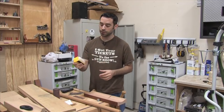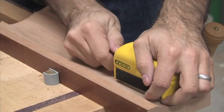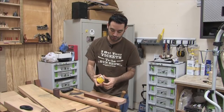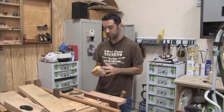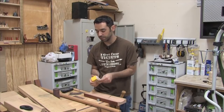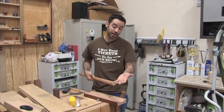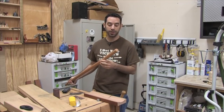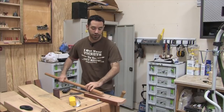Here's another option — a little sanding apparatus with spring-loaded plastic inserts that you can push into the surface and they'll mold to it. You put these little velcro sandpaper sheets onto it and sand away. You'll probably have to change the profile every once in a while depending on the curve, as it only takes on about an inch and a half portion of your cove. The final option, and actually the cheapest, is just using a dowel rod with some sandpaper wrapped around it — just tape it on the back end so it doesn't slip off. That'll do the trick too.